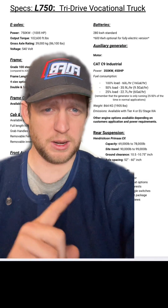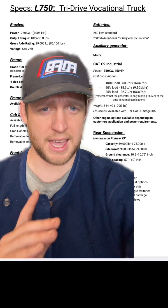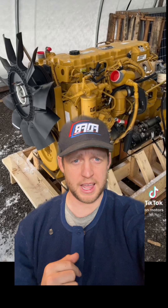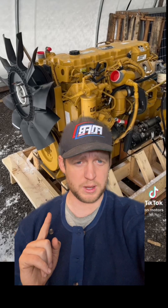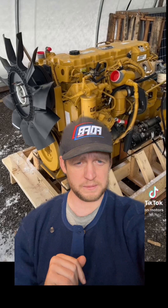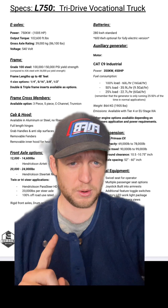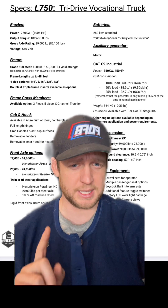Now for the diesel-electric, we have to look at the generator. We went with a CAT C9 Industrial — that's the one in our shop right here that we're putting in next. It provides 350 kilowatts of power, or about 450 horsepower, to maintain those batteries. The total fuel consumption of that motor at 100% load is 60 liters per hour.